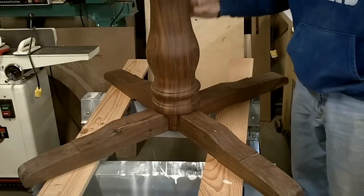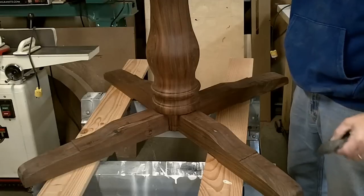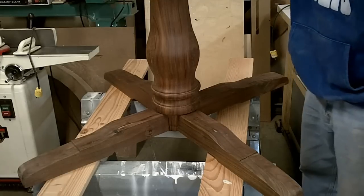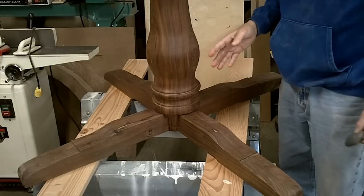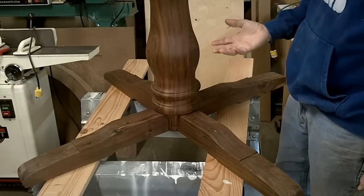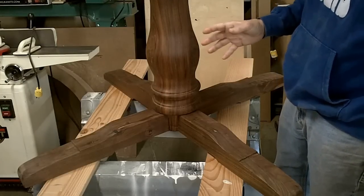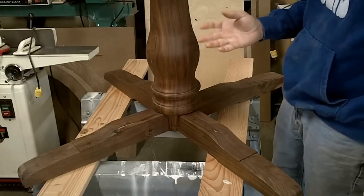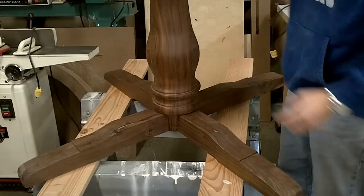I've already put one coat of the blend I use to finish furniture like this. I've been using the same process for about 14 years. It's a polyurethane 50-50 with naphtha. I put a very light coat on and then go over it with steel wool, blow it off, tack it off, and keep repeating the process. I usually put about six to seven coats on. The nice thing is it dries very quickly — sometimes I can put three coats on in a day, about three to four hours between coats.